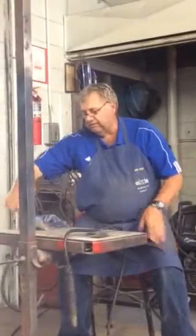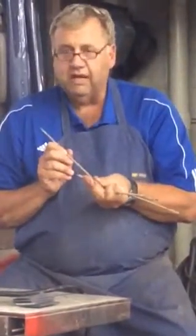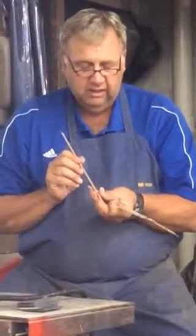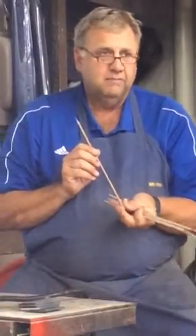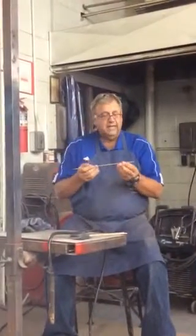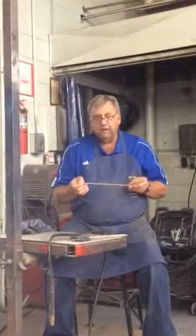A little bit about the rod. This is a quick introduction to the welding rod. This is still a mild steel rod, and it has a coating on the outside. What that coating does is, as it burns off, it produces rapidly expanding gases, and those rapidly expanding gases create a little envelope that protects the weld from oxides and nitrides in the atmosphere. So therefore, that's where you get a pure weld. The only thing that's different about most of the welding rods is simply the coating on the outside, and that's denoted in the number.